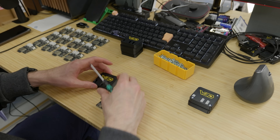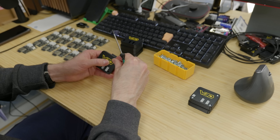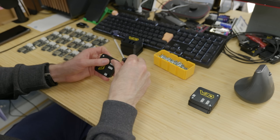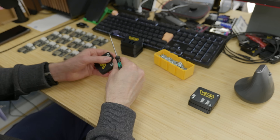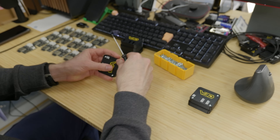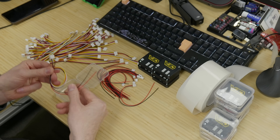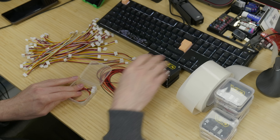With that process done, each of these PCB stepper motor analyzers are now ready to use. With all the individual parts ready to go, we can put them all together: first we open the case, place the PCB inside, and insert the three screws. This is nice and quick since there are no threaded inserts or complicated threads — we just use the machine threads straight into the plastic. While this isn't the most robust connection possible, it's going to undergo only very light usage, so it just needs to hold the case together. We then place each one into a box with the stepper motor cable and power cable, close it up, place a sticker on the outside, and there we go — that's a product ready to go.